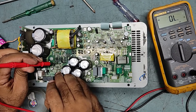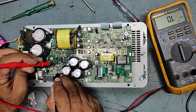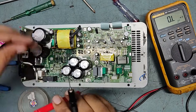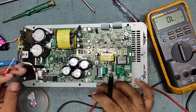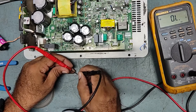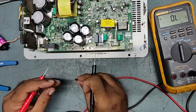After removing the IC, pin 12 is now showing 26 megaohms — before it was showing 70 ohms because the IC was shorted. Checking the removed IC separately, it shows 78 ohms. So our IC was defective — that confirms it.